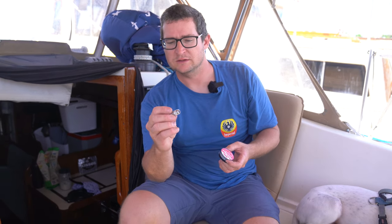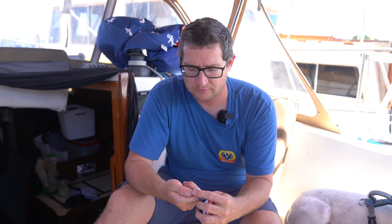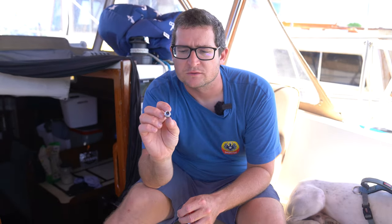This is the Teflon tape I'm using — the most expensive one they have at Home Depot, so hopefully cost equals quality. These are the fittings: standard stainless steel quarter-inch MPT. The important thing when wrapping Teflon tape around a fitting is to wrap it in the same direction the fitting threads in. If the fitting threads in clockwise, wrap the tape clockwise so that as you tighten it, the tape tightens up. If you do it the other way, it'll just unwind the tape as you insert the fitting and it'll leak. Do a couple of good wraps until the threads are filled nicely.